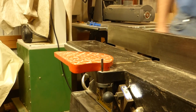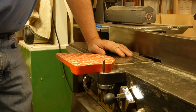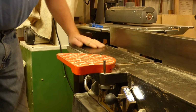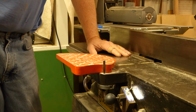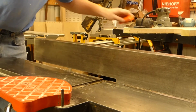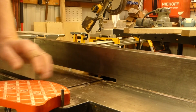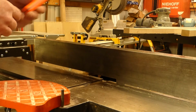If you have any questions, that was kind of a unique way of putting on the blades. I've just done it quite a few times and figured out, never having jigs or anything, how to make it work for me. It's good. There's not too much. There's a belt for the machine. You want to make sure it's tightened. You want to periodically check the adjustment on your blades and sharpen them. Don't get one of these.